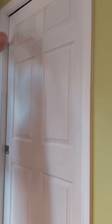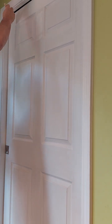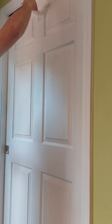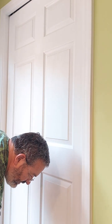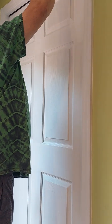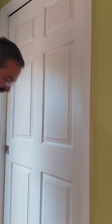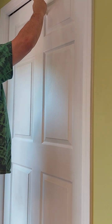You can see I'm not going to take a real wet brush — just go over it real light, just like this, making sure you take long strokes so you don't end up with brush marks everywhere. Just follow the grain. It takes a while; probably going to take about an hour per door. Just take your time, don't be in a rush, and don't make drips. Drips are the spawn of Satan. The big flat parts are actually the easy parts — the harder part is these little spots where you've got to dab it in the corners.